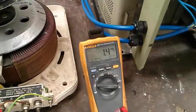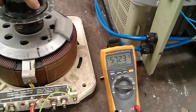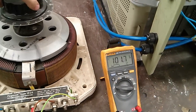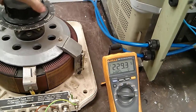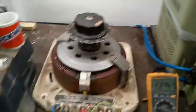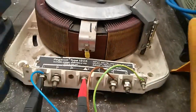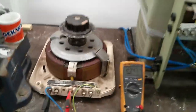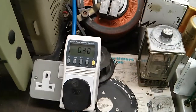That's what you want. Let's get the new one up. 25 volts, 50, 100, 150, 200, 230. This one's also humming nice and healthfully. That's what you want. Still drawing 0.4 of an amp so no load loss there. That's perfect.